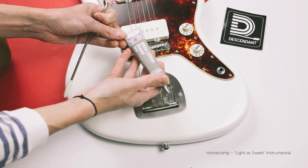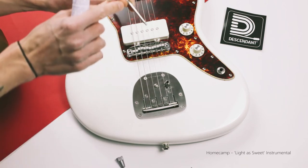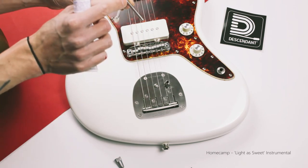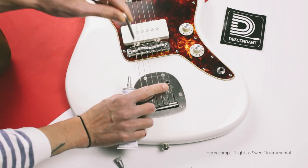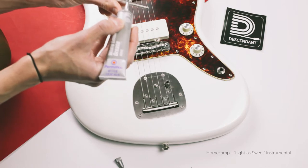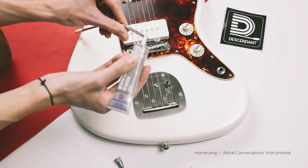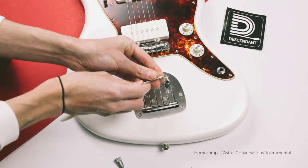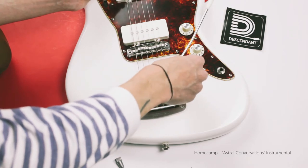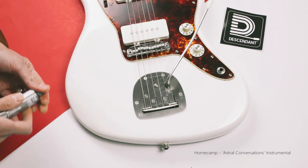With the white lithium grease, what you want to do is just run it along — you'll notice on the back, just before the curve, there's a machining mark from where the arm's bent. Basically that little mark sits right at the point where, when you've pushed the arm fully into the collet, it sits right on that edge. So what you want to do is just run a super thin bead across there, then put the arm in, run it around a few times just to mix it in. That was just a routine maintenance thing to help keep all the parts mated nicely.